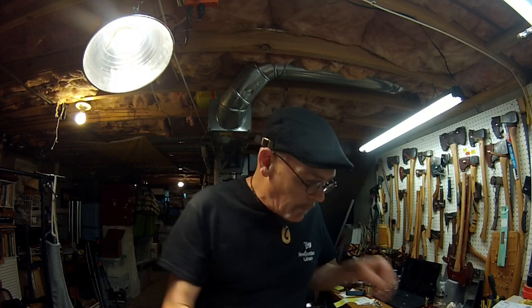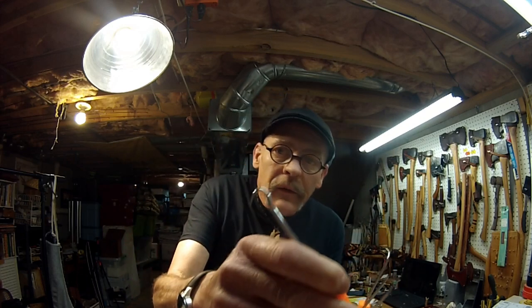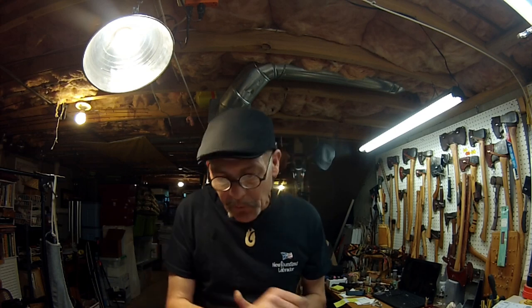And I'm sorry for that, but again, I'll reiterate, Chris Killinger has a fantastic video about how to pull a wedge. You want to pull a wedge when the handle is super dry. These are the tools I use, cheap, from Harbor Freight. Little picks and stuff like this. You get them in there, and you just work that wedge right out. You'd be shocked. I was really surprised how easy I got the wedges out. So, I'm sorry I didn't show that. But anywho, here we go.